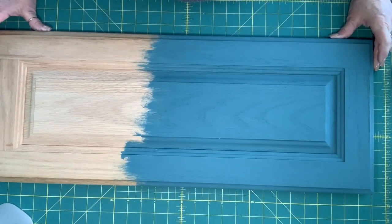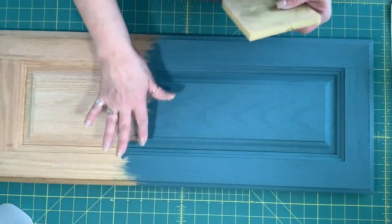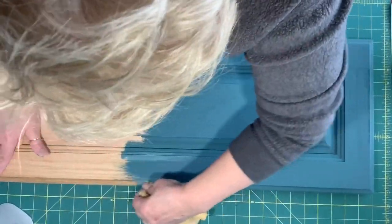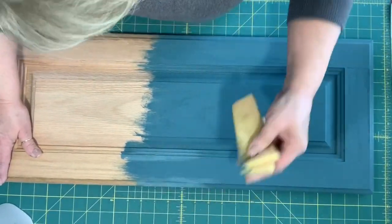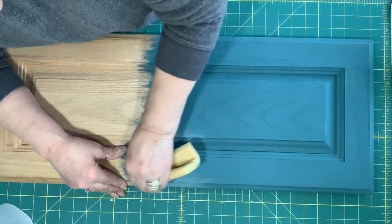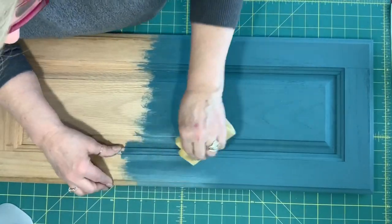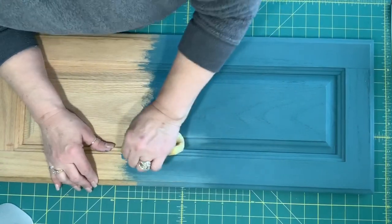We can go ahead and get started with the wax now. This is the point that you would distress this if that's what you wanted to do — you would just take some sandpaper and go into the edges here. Don't let it be too dry or the paint is hard to get up. I'm going to just take a little section here and distress it a little so you can see where the paint comes off on the edges. When you distress, it should look like what a cabinet would look like with age — around where your hardware is, little areas that were touched constantly over the years. All you want is this undercoating — whether it is an old stain, or if you painted white or black underneath — to show through. Just enough.